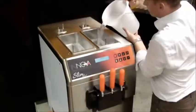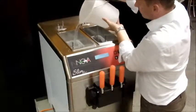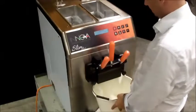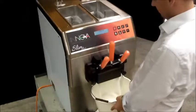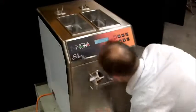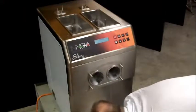Remove all the product remaining in the tanks and cylinders. Use hot water in the upper tanks and remove it from the cylinders. Repeat this process until the water is free from any residuals. Remove the tap and the blades and clean every remaining part, then clean the cylinders.